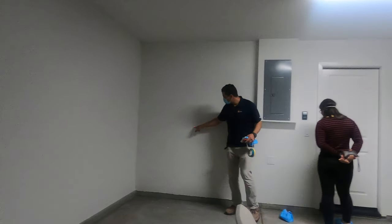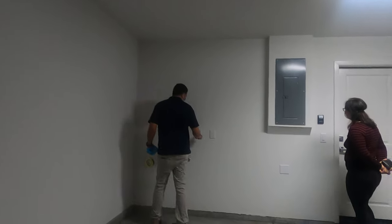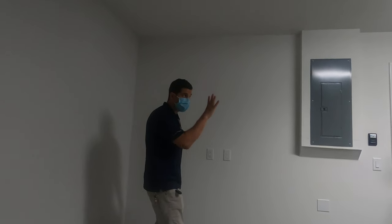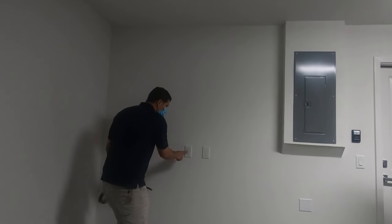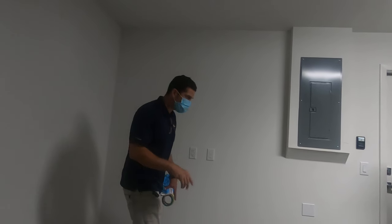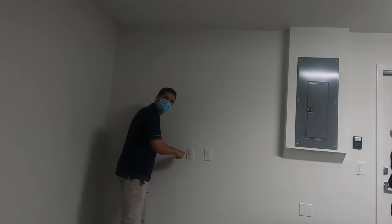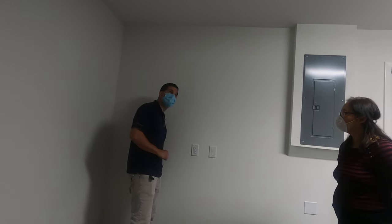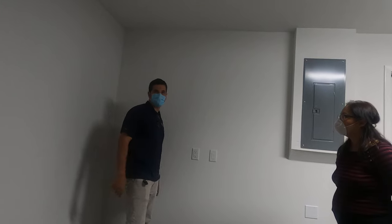Remember: if you lose hot water and there's a little red light, make it go away by resetting it. Keep in mind that all three bathrooms share one GFI outlet. So if you lose power in a bathroom but don't see a push-button reset, go find the other bathroom that has it, check the little red light, and reset it there.